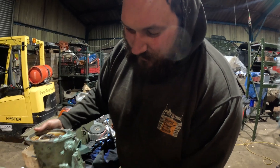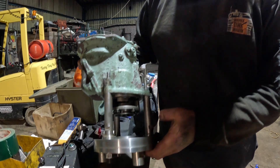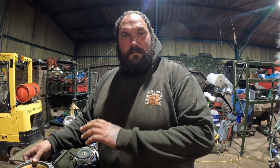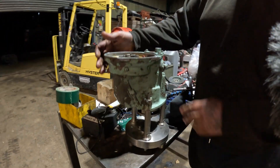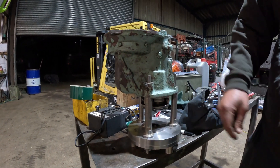It works as a nice stand for the magnetos. When we were making it, we wondered why Rolls-Royce went for a really thick bottom base plate. Being from Norfolk and agricultural, we thought we could make it cheaper with a thinner one — but nope, if Rolls-Royce made it like that, we'll go with that. Turns out, because the magneto is offset, if the base were skinny it wouldn't be heavy enough to hold the magneto up.